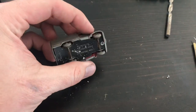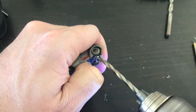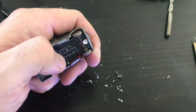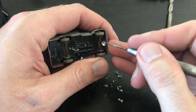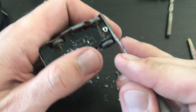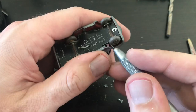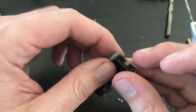Go ahead and drill that out. Once I've got the center hole drilled, the next step is to remove that flange. I use a really sharp bit for this and go nice and slow — I don't want to remove too much, just inch my way up to it. A lot of times even if there's still a slight little flange on the edge, that's good enough. I can clean that out, and the outside piece usually will flake up. I'd much rather remove too little and come back to file it off than remove too much and end up with a sloppy fit. That base came off pretty easy.